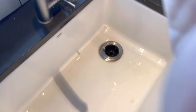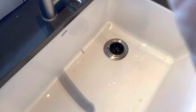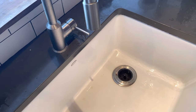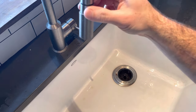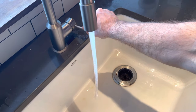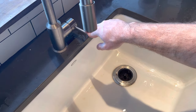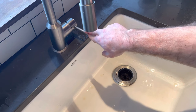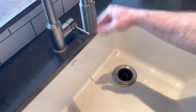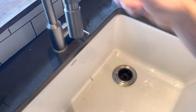Faucets, whether it's a bathroom or kitchen, they have what's called an aerator and those can get clogged up. The easiest way to test if your low pressure is not something serious and is just a clogged aerator is to test your different faucets in your house. If your kitchen's running low but your bathroom runs just fine, or vice versa, then it's likely isolated to that faucet. And hopefully it's just your aerator because that's an easy fix.